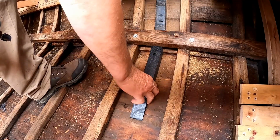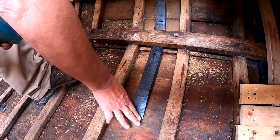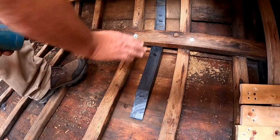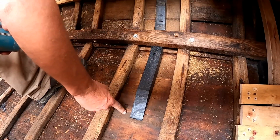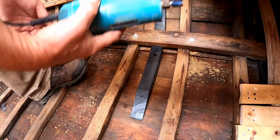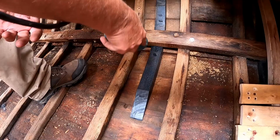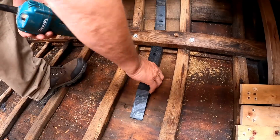Okay, with the plastic frame in place, now I have to find a way to cut this arc nice and neat. So basically, it's an arc on here that forms a 16, maybe 18-inch radius from an arbitrary point up here in space that is on a plane following that surface and meeting the inside of the planking. So it's a little bit complex, but we'll go into how we devise all that. The way I'm going to cut it is by swinging this router in an arc, basically from there down to where it meets the planking, finding that magic point, which means I have to build a jig to do all that. And I think I know how I'm going to do it.